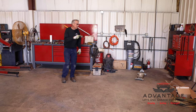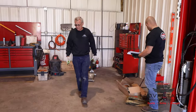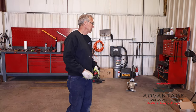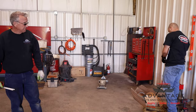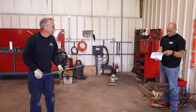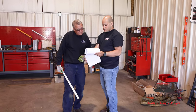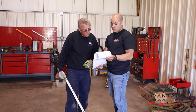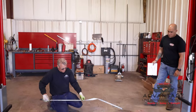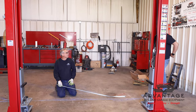Okay, now, the new manual. The new manual has our dimensions. It'll actually give us the outside dimensions of where we're supposed to set the lift up in inches. So Sean's going to look up that number for us. I think it's like 135 and a half. 134. Okay. Yep, outside to outside. 134 and 7/8. So roughly 135, which would be 67 and a half.